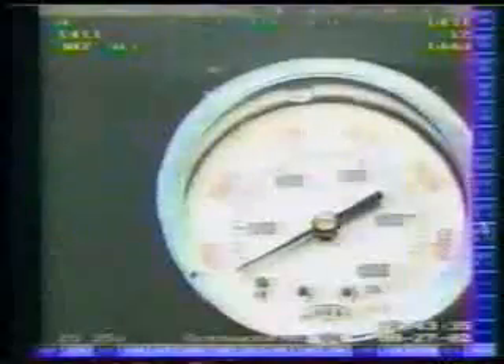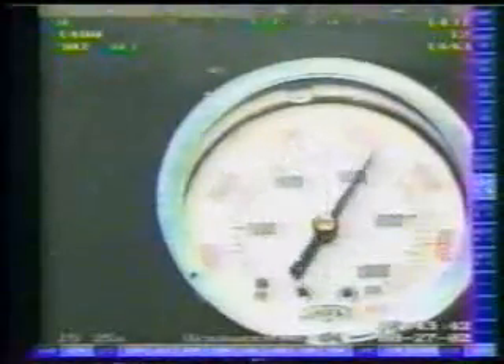The seal was then strengthened by applying a series of pressure cycles. The pressure was bled off to zero using a bleed valve on the manifold. After each bleed off, the pressure was rapidly increased to 10,000 PSI and held for a one-hour period.